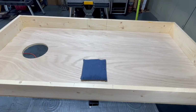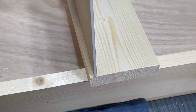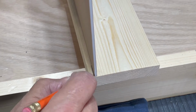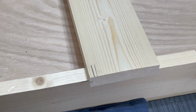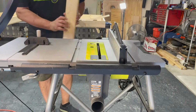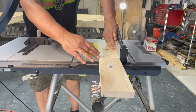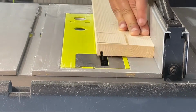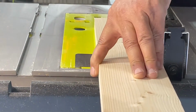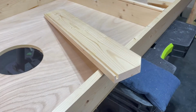I remove the boards and grab a flat piece of 1/8 inch material that I will use as the door. I position the board about 3/8 inch from the top of the 1x4 and I mark both sides of the 1/8 inch material. I adjusted my table saw to those marks and made 2 passes to cut in a long slot on the top of that board. After the second cut, I test fitted the 1/8 inch board in that slot and it fit great.